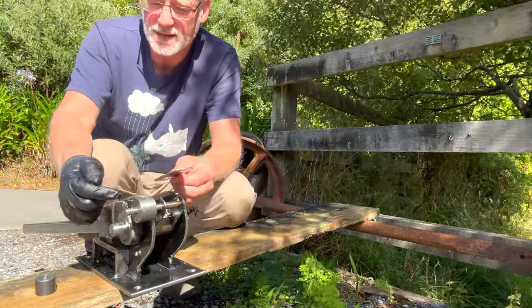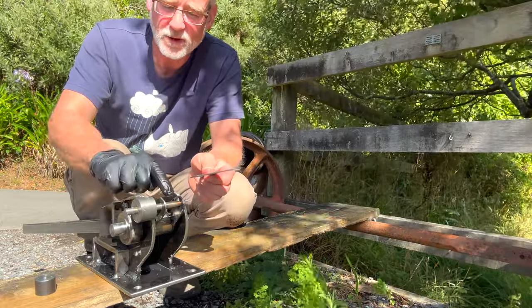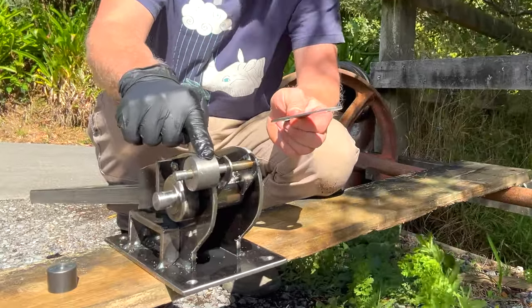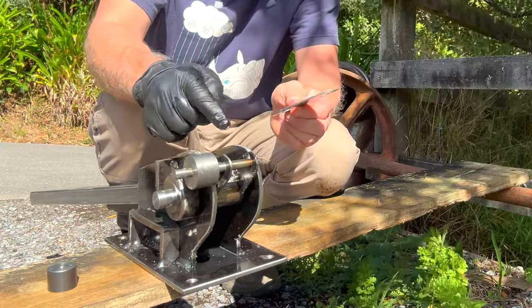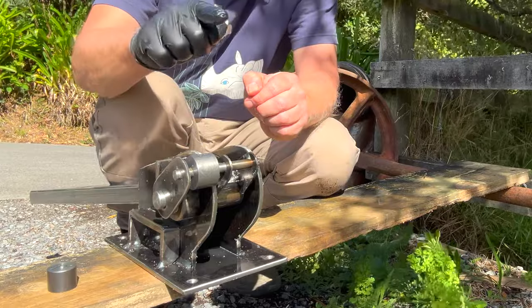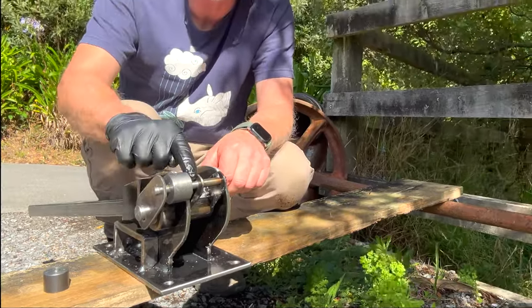The purpose of this additional plate is quite simply to tie the ends of these two points together. We've got quite a lot of force on this pin, and there's a possibility that when bending particularly thick or heavy-duty reinforcement bar it could actually bend at this point. This plate will support the pin at both ends — it's welded at one end and now supported by the pin on the pivot at the other end, so this cannot bend.